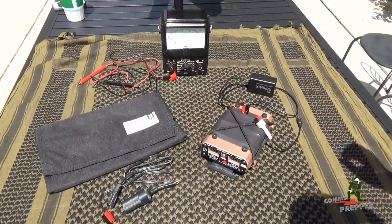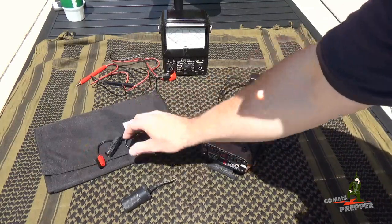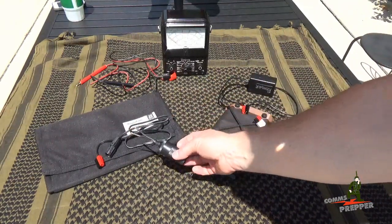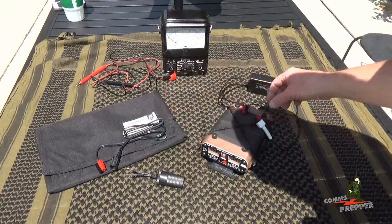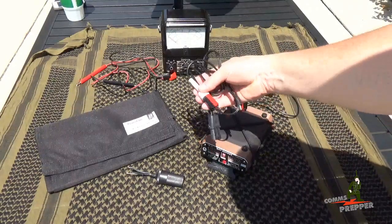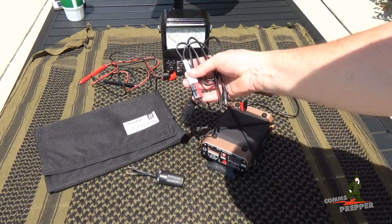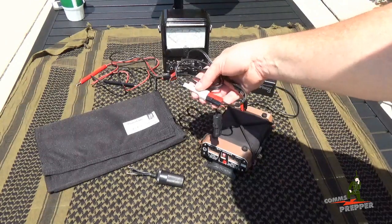The power film flexible solar panel provided by FlexSolarCells.com came with a cord and a cigarette lighter adapter, which I cut off and put matching Anderson power pole connectors on there, so I can move this plug from the wall wart charger. By using the Anderson power pole connectors, it allows me to move the plug for charging the QRP Ranger between the wall wart and the flexible solar panel.